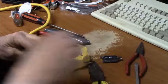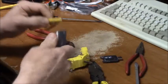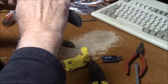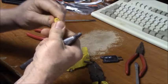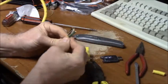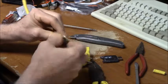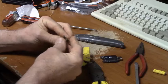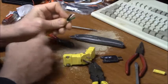Well, if you look at the end of the extension cord, I'll strip back a little here. I'm not going to need to strip it very much. We might have to shorten them up. Just score that so you don't get into your conductors. These are in a particular order, and to wire your plug, so if you go out and buy a piece of rubber cord to make an extension cord, you'll have to look to decide which is the right end.